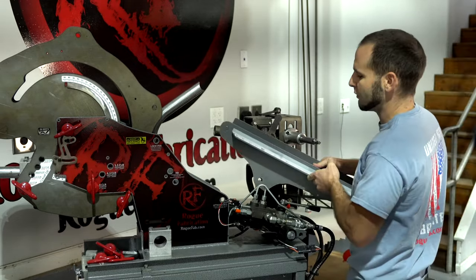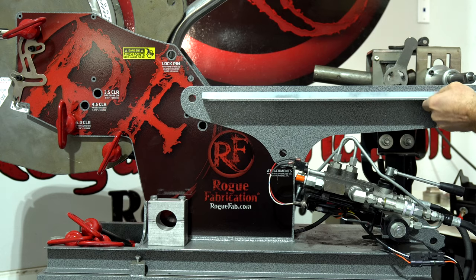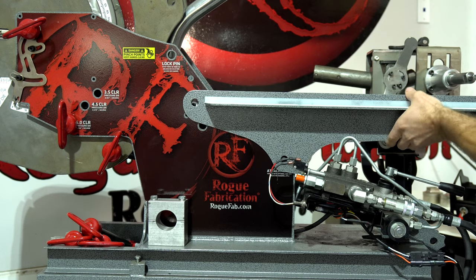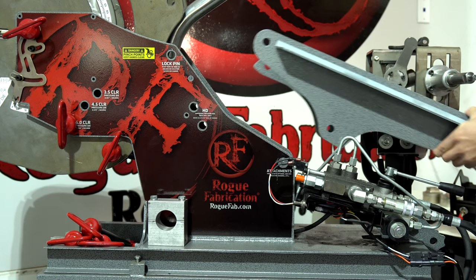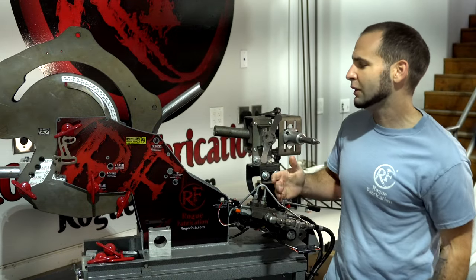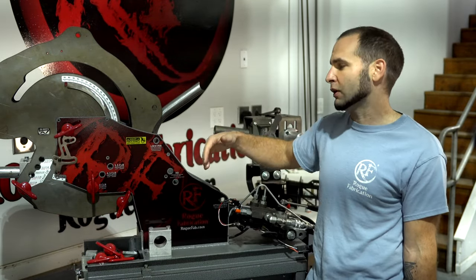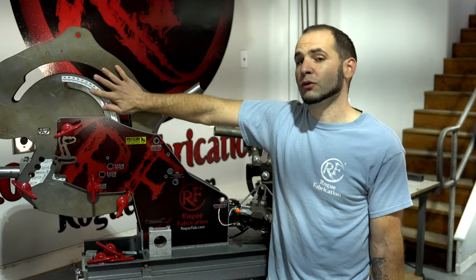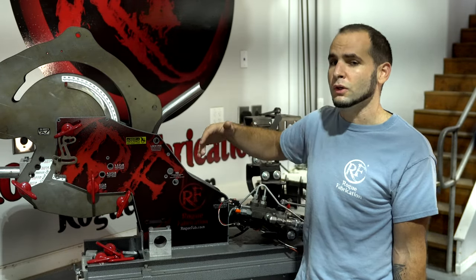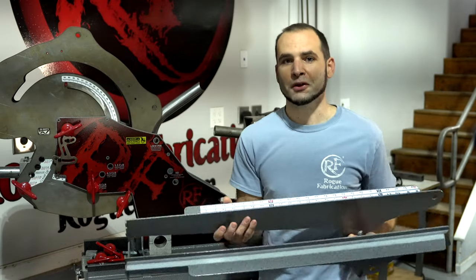If you just pivot them from the back they'll install quite easily. One last tip: when using your backstop assembly, don't forget to make sure the machine is set to zero — or whatever degree you initially set the backstop position with — because as you vary the bend wheel position angularly, you'll also vary where the tubing is stopping up against the carriage on your backstop assembly.